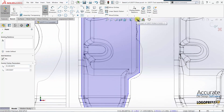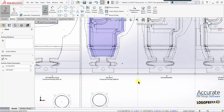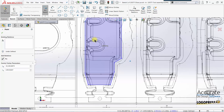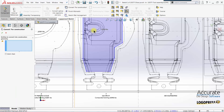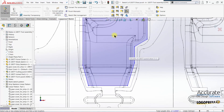Now I'm going to show my sketches and use the vertical and horizontal center lines that Logo Press gives us to dimension this punch. I'm going to use a Logo Press sketch tool called Convert for Construction — converting that horizontal line and these two vertical lines — and then I'll place some dimensions.